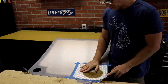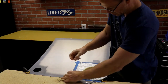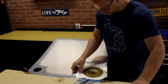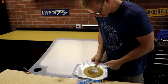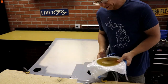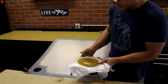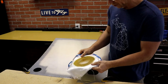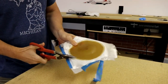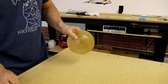All right, so this is day two. This is completely dry now — I let it sit overnight. So I'm going to peel this tape off and break this free of the duct tape. See how nicely that comes off? That's because this resin won't stick to duct tape. Here it is — this one actually looks really nice. There's still a little bit of a flat spot right here which I can fill with putty, but it's a lot shallower and should fit nicely on the wing. The next step is to cut this out, and I'm just going to rough cut around the edge with a pair of shears.